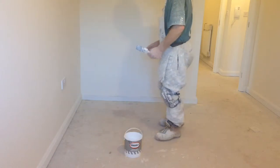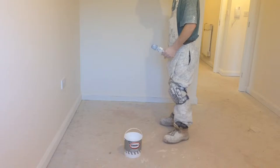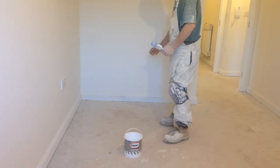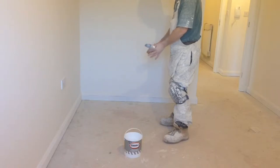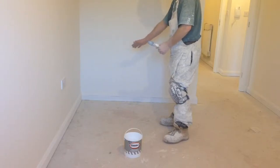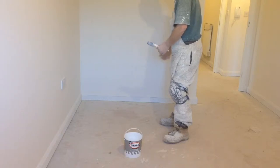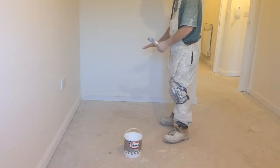So what we're going to do here is a section of skirting board. On this particular piece I've replicated the effect that if you've got a carpet down in your own house or a private job, you'll need to mask and tape the carpet or the floor underneath the skirting if possible, so you don't get any paint on the floor surface.